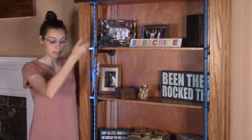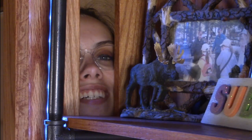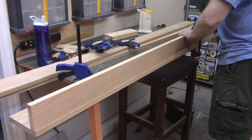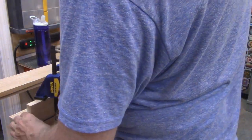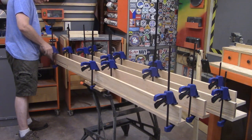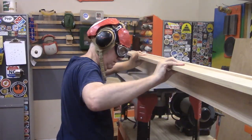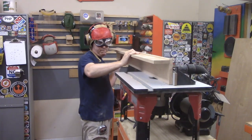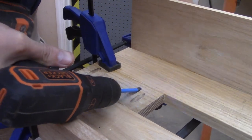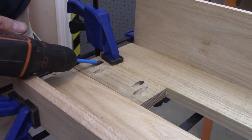Now that the pipes are together, we have to create the wooden pillars. What some eagle-eye viewers may have noticed is there are gaps here. This bookcase has four vertical pillars and each pillar is made of two strips of oak that are attached together — here I'm gluing and clamping them. The back of the bookcase will be a quarter-inch piece of oak-faced Luan plywood, and the slots I'm making here will hold that plywood. The pillars are separated to provide that slot, and the first step is to put little separators in between the two left pillars and the two right pillars.